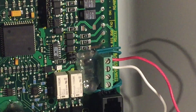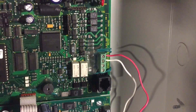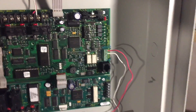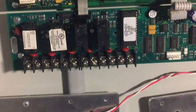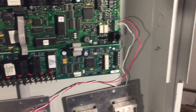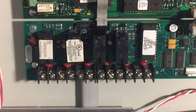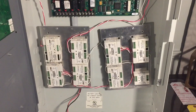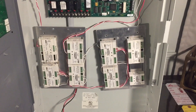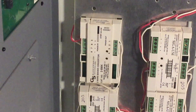I actually had to do repairs on this because when I got it, the terminal block was very loose and broke off, which is not good because that's the only place I can hook up devices to. Underneath is an expansion board with two more NACs, which I don't have connected to any source so they're just acting as relays. There are also another two SLCs that aren't programmed into the system, so the expansion board was only used for the NACs. Underneath all that is a bunch of monitor modules — eight of them — installed to handle the existing zones from the previous 2001 system. In the bottom right is a relay that controlled the existing fire doors, and at the top left is a monitor module that monitors how much voltage is going through the two-wire smoke detectors.